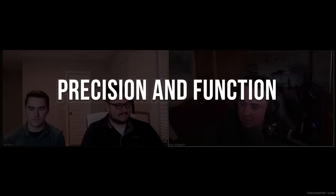Let me get back to the precision discussion. One of the things I've always maintained is that there's a relationship between precision and function. You don't develop the type of precision we see in these parts — nor in aerospace parts or semiconductor industry parts — without a return on the cost. You develop precision down to these levels because you're chasing a return on function. Do you guys agree with that? That's why we do that. Yeah — it's what we call design intent. The whole idea of how we do things in the modern world is you take a CAD system, you design something, and that is what we call nominal geometry — what it should look like if it's perfect.